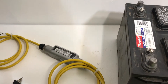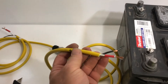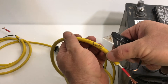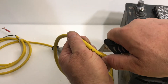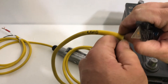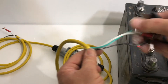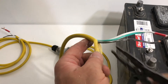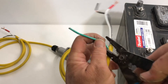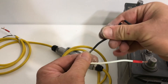What we want to do here is cut the zip tie. This battery has about 10 inches of wire here, so we need to open up this wire. Be careful, don't cut yourself — just gently open up the wire. Strip it back like this, and trim off the housing. We don't need the green wire. This white wire is going to be the positive side, and the black wire is going to be the negative side.